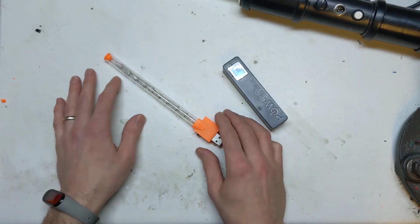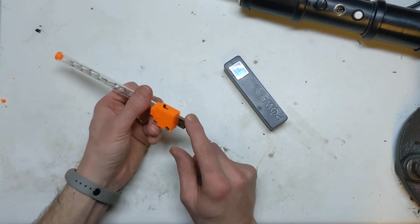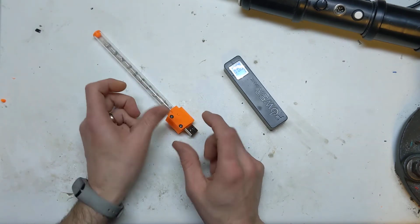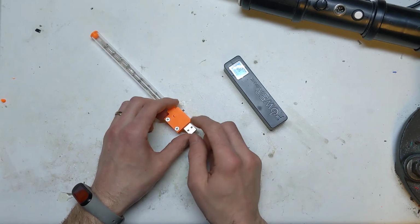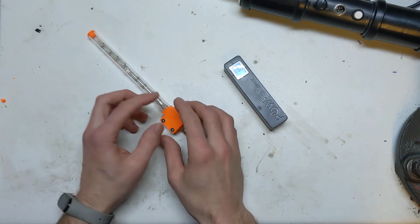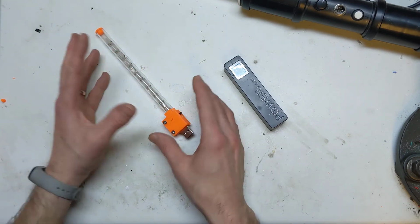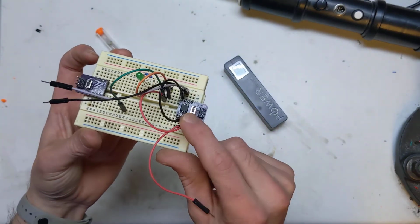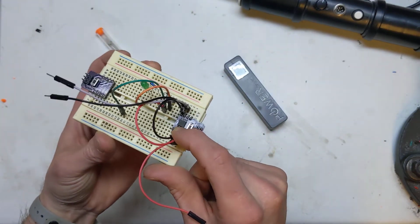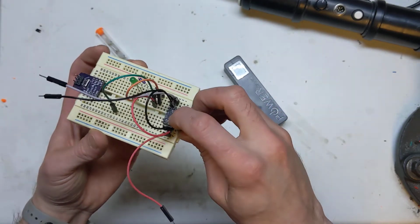The boards are really small and cheap. This is not used for programming. I just use one of those SOP8 clips that you can clip onto the chip. Normally what I do is breadboard out the code on a breadboard, using this adapter I made, where I soldered the SMD version of the ATtiny85 to it, with the breakout pins and reset button.